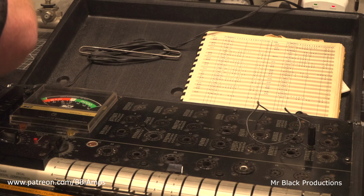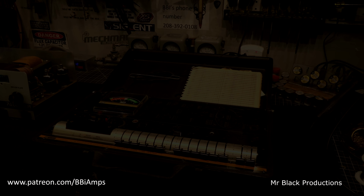Nothing. All the final tubes are at 70 or 80%. Yeah, we'll call it 70%. Okay. Needless to say, no shorted bad tubes. 70. All right. Let's get the 747 put away.